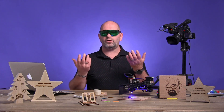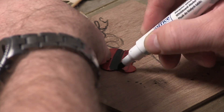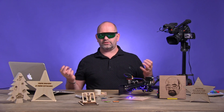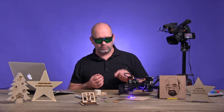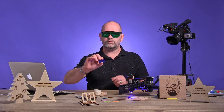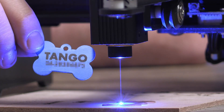Because the aluminum will reflect all the laser light back to the environment, and therefore it won't work. So what I did, I used a whiteboard marker and I painted the surface of that aluminum black. With that black painted surface, it is now able to absorb all the light and transfer it into heat, and that heat is what is engraving the metal. We will see how it turns out, but I know already — with this dog tag — that it worked. This is an engraved piece of metal, and it works out fine.